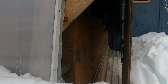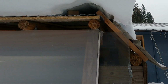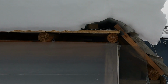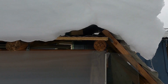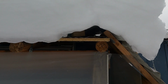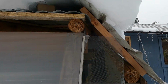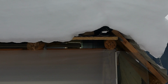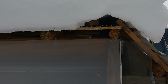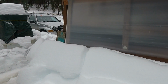And then here's the back of that shed, and you can see I've got this big gap at the back wall letting air move. See how right there my little chimney system comes up to this roof, and I've got a ridge cap on there so that all the hot gases that come up off the forge can get up into that, and then it still acts like a chimney, and you can see it's open on the other side to vent out any of my hot gases. So I did put a little bit of thought into my design to let the air flow and not poison myself.